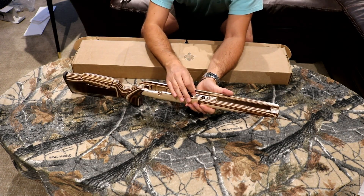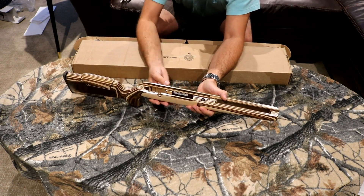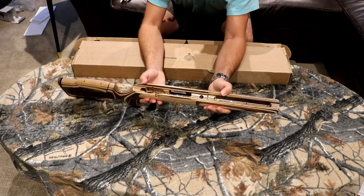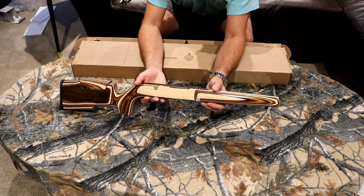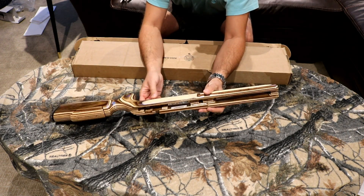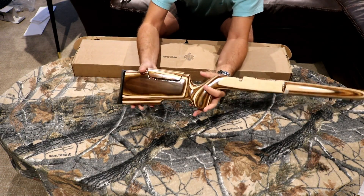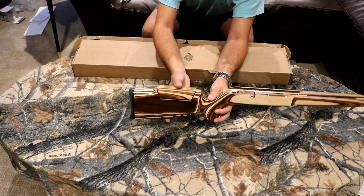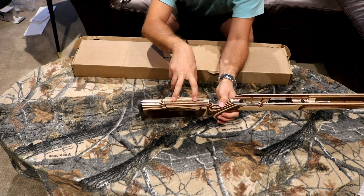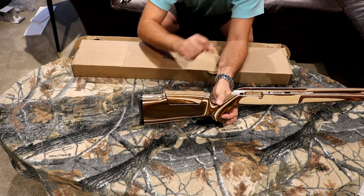Taking a quick look here — it looks like if I wanted to do some pillar bedding I could definitely do that, but I'm not going to do anything out of the box. I'm just going to mount this stock and guess on some inch pounds. I usually find with Boyd's wood stocks that 35 inch pounds is adequate, especially for a 204 Ruger that has virtually no recoil. I'll also be playing with the adjustable cheek riser — it looks like there are some Allen key holes here, which is probably why they included that Allen key.